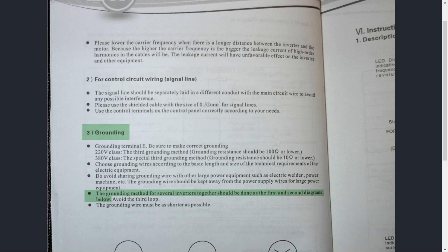Using a quality meter, go through and double-check grounding resistance on your system. The entire system should be at 3 ohms or lower — I cannot emphasize that enough. Be aware that certain systems have components not making metal-to-metal contact — for example, if you're using plastic roller bearings, they're not conductive, so the ground won't pass through those components by conduction. You'll have to go through the entire system and validate those specific areas to confirm you're at 3 ohms or lower.